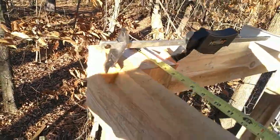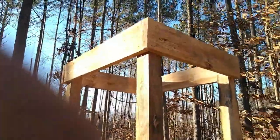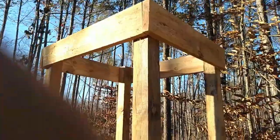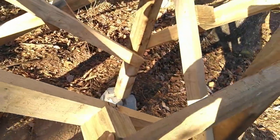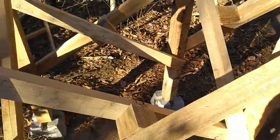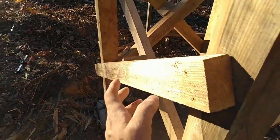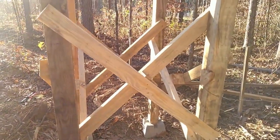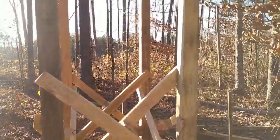I've got the four supports up there, everything's nice and parallel and level. To finish it off I came down and used the tops of the 4x4s — cut, trimmed, and screwed them into the two cross supports. That'll help eliminate any deflection in the beams, keeping the cross supports from deflecting outward and keeping everything tight. That's it for part one. I'll take the IBC back to the shed, work on putting the roof on it, then bring it out with the tractor, put it on the forks, and set it up on top.